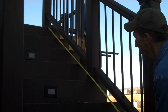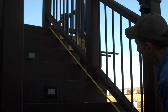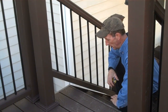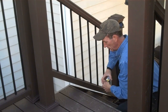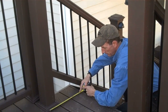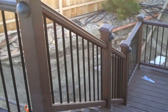We're pulling our measurement from the top of the top step to the top of the bottom step for our overall length, and we're going to find the center points for each post. Now every set of steps is different. On this one, the post we'll attach to is not set right at the corner. So after we get our measurement to the top of the step, we want to pull the dimension for how long we've got to run the flat. It's the same on both of these, and we'll be putting the upper rail over here on the left side.